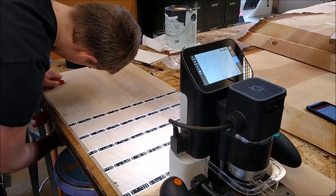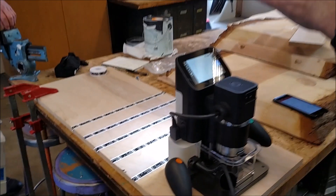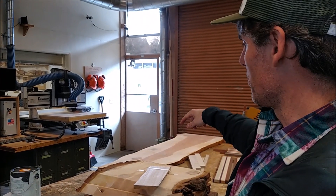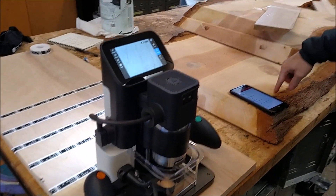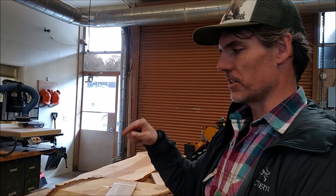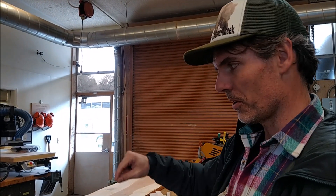I made a walnut bed — got an inch and a half thick walnut — and I had a large eight-foot piece with four rows of tape clamped to the top of my workbench. I would put the walnut pieces up next to that, fix them at the end, and cut the ends of the finger joints for the side of the bed. The really cool thing is I just cut the ends of the finger joints, then used my track saw to rip the long cuts. So you can use a combination of the Shaper and a track saw to make larger pieces. For some of this CNC furniture like the open desk and conference table, if you just come around the corner to get the beginning part of a straight cut and cut the more complex end, you can pull it out, lay your track, line it up with your cut, and use the track saw.